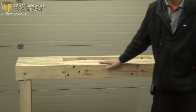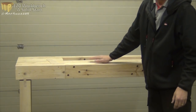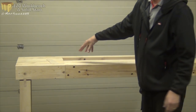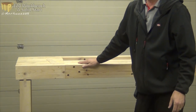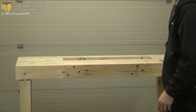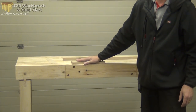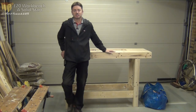The other potential problem with having a softwood bench is marring it, denting it when you're doing chopping operations on top. Now you should never be chopping directly on top of any bench because you're going to mark it, but on softwood obviously the damage you can do is more extensive. So really just use a bit of hardwood or a piece of ply as a sacrificial base when you're doing your chopping. So that's how I got to this stage, and in the next video or two I'll show you how I make some accessories for this bench.